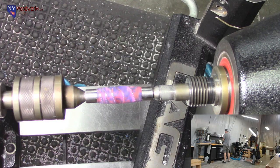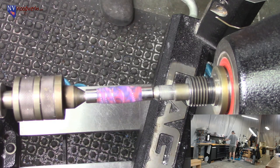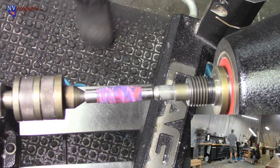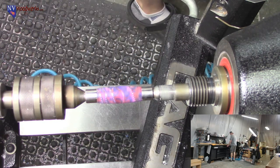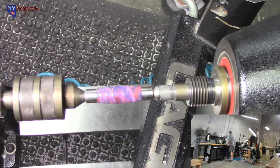So you might wanna talk to Ken Rizza over there if you're looking at these things, he knows what he's talking about. But I got the super mega square one. The nice thing about it is you can use the side of the wheels very easily to do skew chisels and different stuff. So I got that on the 600, and then I have a 180 grit 4-in-1, which is the one they have, and those are pretty cool too. But really, any CBN wheel is what I would recommend if you have a grinder set up. There's really, at this point, no reason to have regular grinding wheels. They just suck. I've had the 180 grit and an 80 grit for many years now, probably 5 to 6, and they work fabulously.